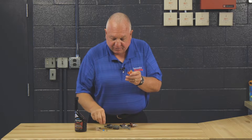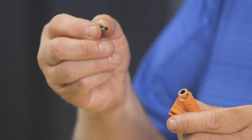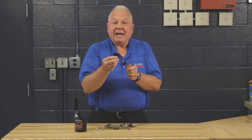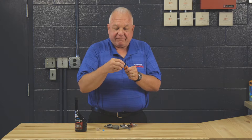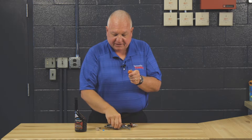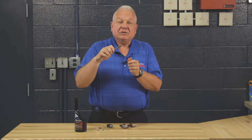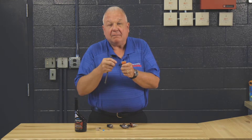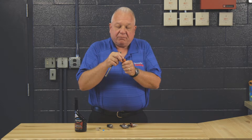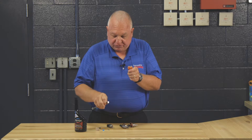The other thing a lot of people don't know is that inside the top of the injector — the feed side — there is actually a little screen. When the injector gets serviced in a professional injection shop, they replace this screen. A special slap hammer with a screw is used to pull the screen out. So if you have this little tool and you want to do it in the farm shop, you can buy those screens. And if you take the injector out to change your O-rings, you may want to pull the screen out and put a new screen in.